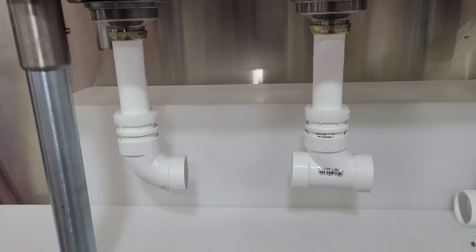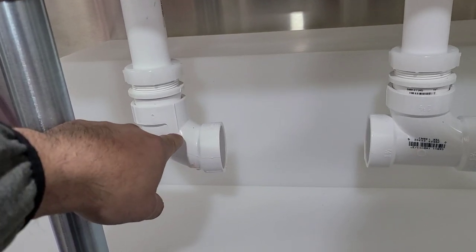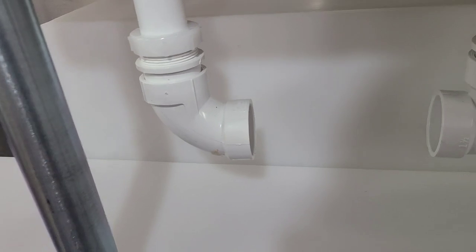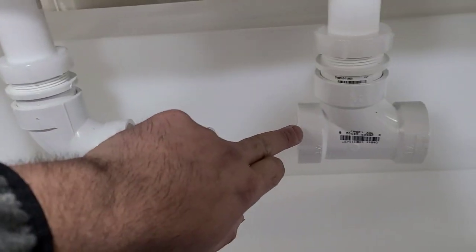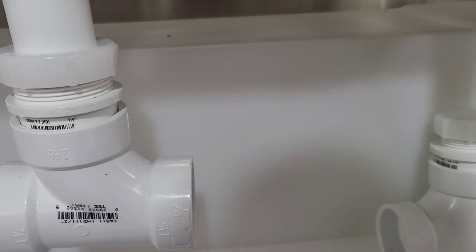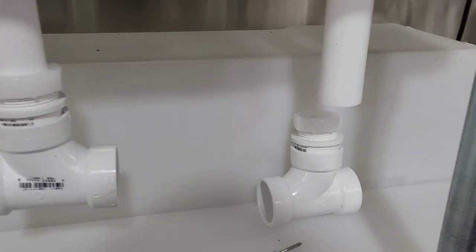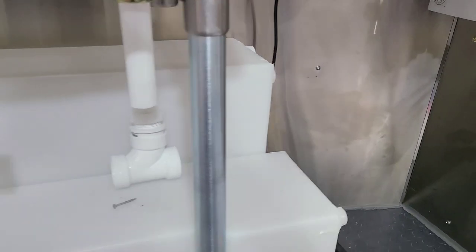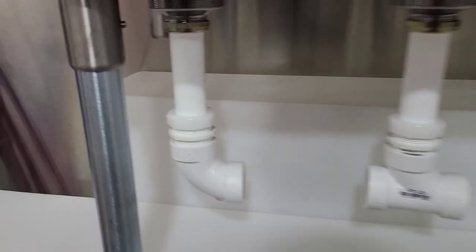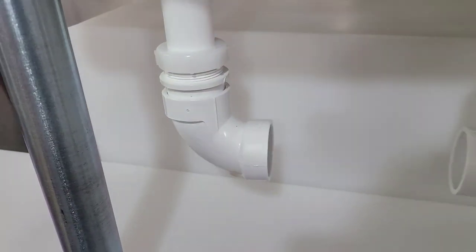This is the general visual concept — this gets pushed up to the top. Actually, this is the wrong elbow; there's a shorter, sharper one that I have on my food truck. This gets connected to the one-and-a-half-inch PVC, which connects to the trap adapter. I think I also grabbed the wrong trap adapter — that one is an inch-and-a-quarter and there's a one-and-a-half-inch — it must have gotten mixed into the wrong bin. Let me show you how it looks on my existing food truck.